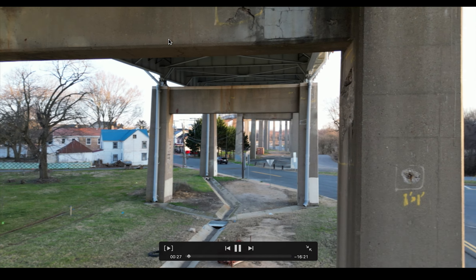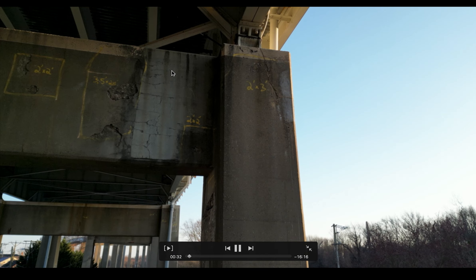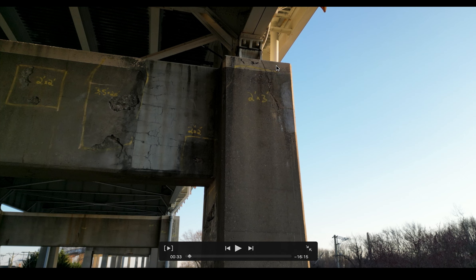This will also remind you of the deck in the Royal Towers, with the swelling and issues. Let's pause — that connection allows the bridge to flex and move. This looks like a repair; at one time this was a repair. You can see the different colorations and the bald concrete. It's concrete that's flaked off. You can see the mapping showing right back through the repair — they didn't go deep enough or secure enough to stop this mapping.